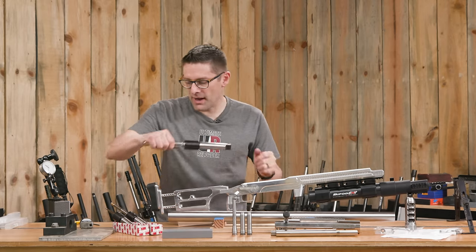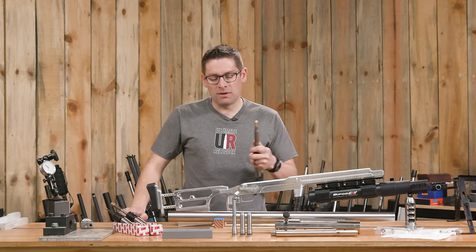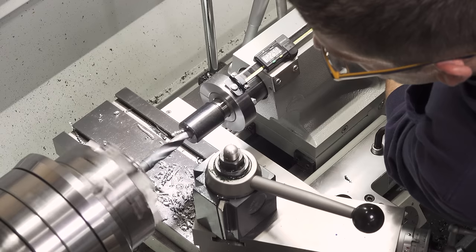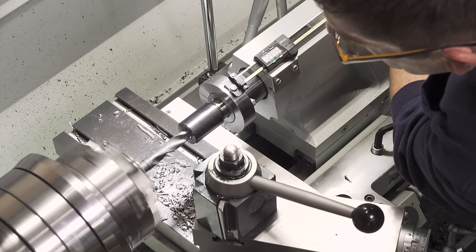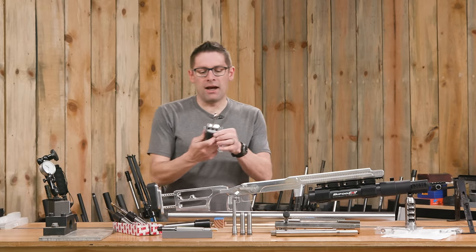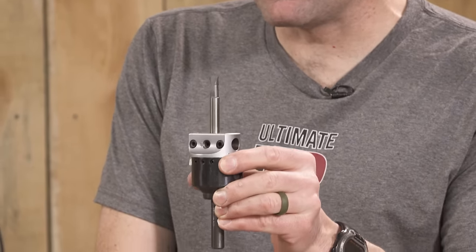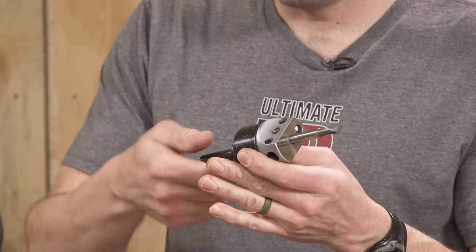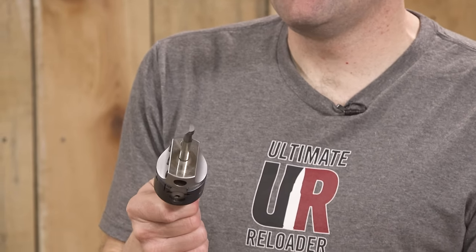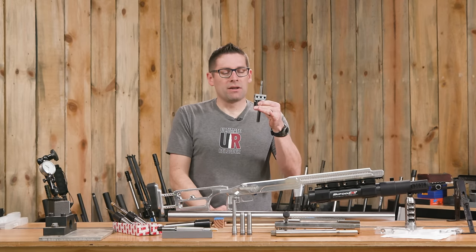For my last project — the 18mm rigid reamer holder — I did this in two different drilling steps. You're going to pre-drill the bulk of the material, and then affix a boring head in your headstock. I had an experiment that didn't go so well initially. I was grabbing on the straight shank and chucking up on that in the headstock, and I was getting a ton of chatter. I thought to myself, that's not a very rigid tool — it's got this tiny little straight shank on it.